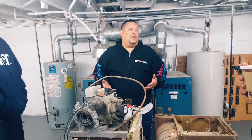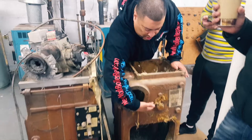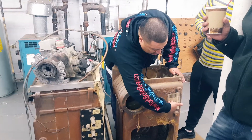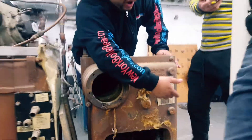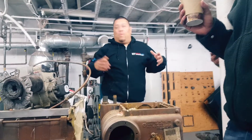The reason why you can cheat is because the waterline — let's say the waterline is halfway over here. So we know the waterline is somewhere right around here. This is the waterline. From here under, we know it's water; from here up is air, because it's making steam. So I can put a pump, as long as it's submerged in the water, to make it like a single hot water loop to heat up the basement.